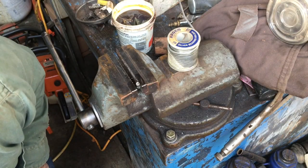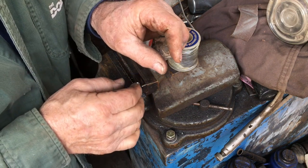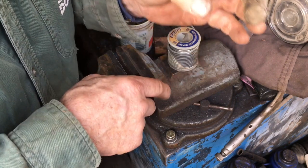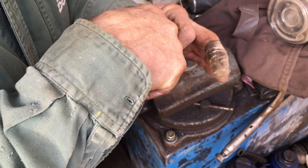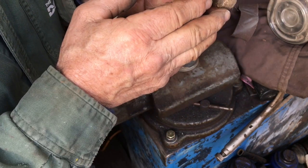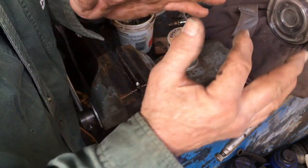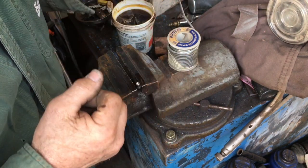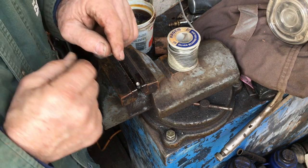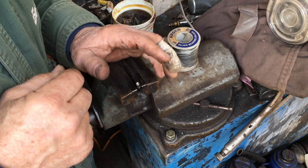What I'm going to do then is take this and chuck it back up in the drill press once it cools down. I'll re-drill that center one eighth of an inch until it gets down to where the actual orifice penetrates. By doing that, that's going to give me the taper with that eighth-inch drill bit to center up the orifice drill so that I put the orifice drill dead center through the center of this orifice. That way, as the gas passes through the orifice and into the venturi of the burner, it hits the venturi dead center and won't go off to the side or at an angle and mess up the flow — the mixture of the air and the gas. So I'm going to turn the camera off and go ahead and solder up the other remaining ones, and once they all cool down I'll go back in the drill press and re-drill these to the right size.